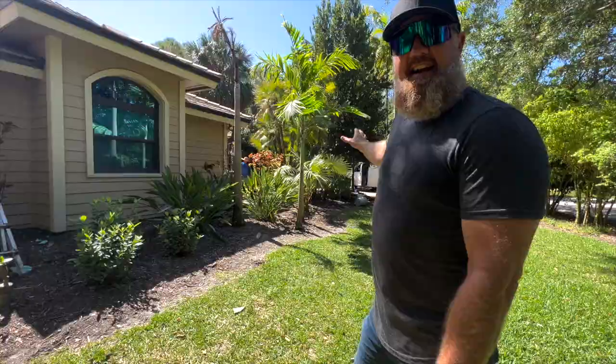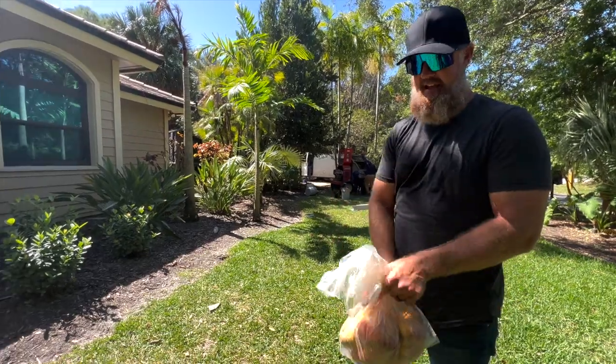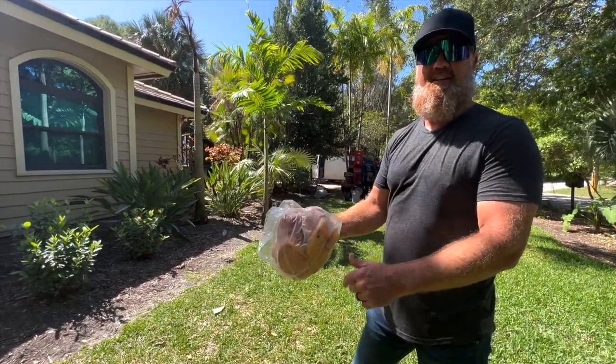Behind me, you can see the guys are mixing the cement. They're mixing the cement for the hip and ridge and around those voids at the goosenecks and leads. They'll take the oxide, put it in the mixer, and have this blended so that it matches the concrete tile roof.